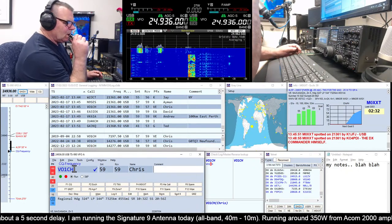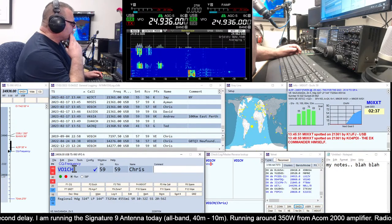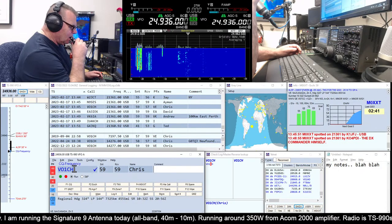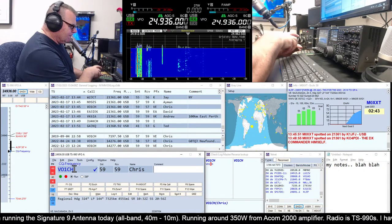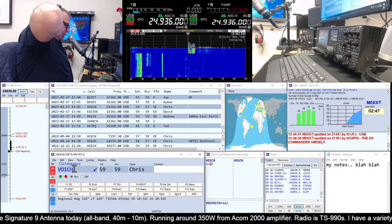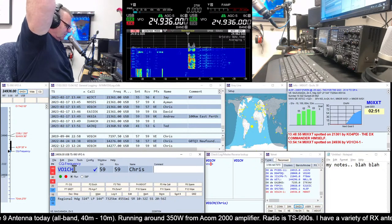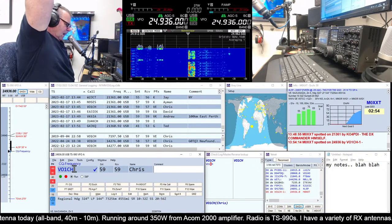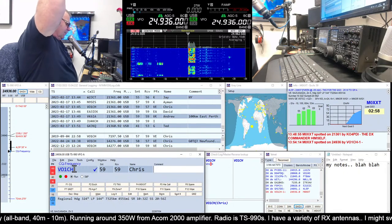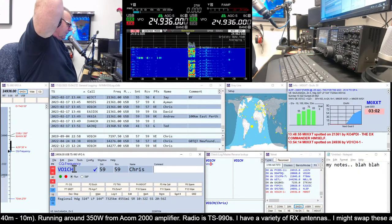Yeah, no problem. You're a real 5 and 9. You're stronger on this band there, Carl. 15's a bit unstable at the moment. Was it 15 we were on? Yeah, 15 is a bit unstable. This is a good one here at the moment, Carl, over. I mean, this is literally just a quarter wave on the ground, so 2.8 metres, 2.75 metres, with about 30 short 3-meter-long radials. And that's all it is. Power's the same at about 350, over.